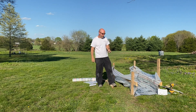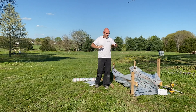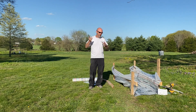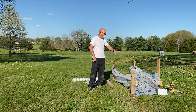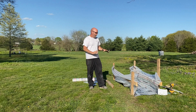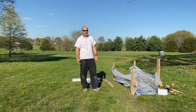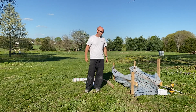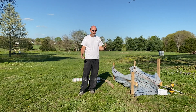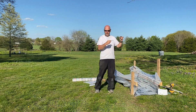There's also an upgraded version — the mono pour system — and I'll take you into the shop to show you a mock-up. I wouldn't recommend DIYing the mono pour; it's a couple levels trickier with more that can go wrong. But if you're pouring your own walls or you're a contractor, you can upsell this — a few hundred dollars for the form and your client gets a much more functional footing. My guys love working with it because, just like everything else with ICF, it's lightweight. One to two guys can do a whole footer in a few hours and be ready for inspection.